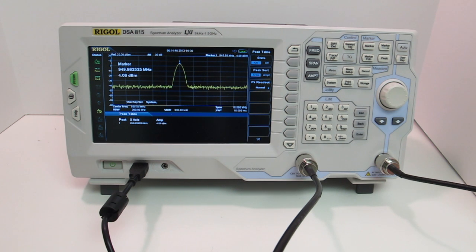This unit also has a tracking generator built in. If you've never used a tracking generator, they're very handy for determining correction factors. This analyzer can correct data for you in real time — if you have a correction factor file, you can load it in and it'll adjust the amplitude based on frequency depending on that correction factor. I'm going to switch over to a different circuit, a filter circuit, to show you the utility of a tracking generator.